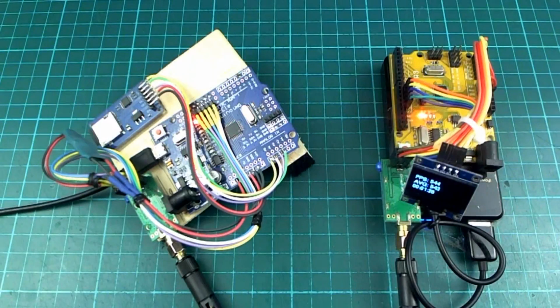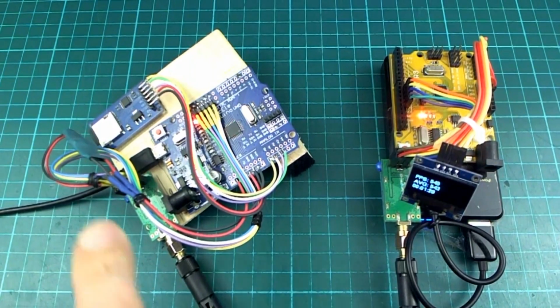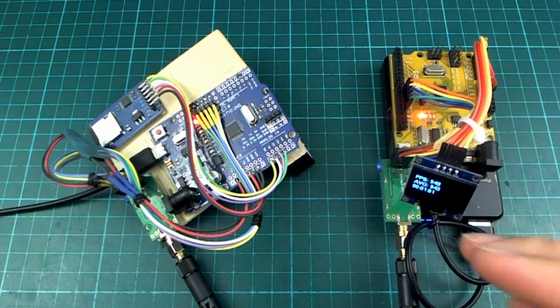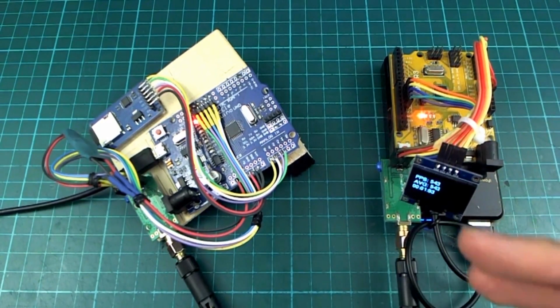Hello, that's right, it's time for another range test using these nRF24L01 radio modules, commonly used with Arduino for sending and receiving radio signals, plus two big Yagi antennas, one at each end. The aim of this game is to see how far away we can receive the radio signals from. So I'm doing this at the 250 kilobits per second signal rate, or data rate, which is the slowest that they go and is the most reliable for receiving signal at a distance.